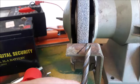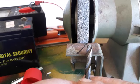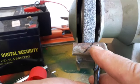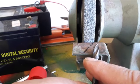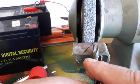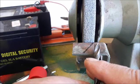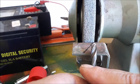Another very important factor: you see the cutting edge that I put last on there. If you look from the side, from the cutting edge to the back side, it must slope a little bit downwards. If I look at this one, it is rather straight or even runs up a little bit — and then it will never cut. That's exactly what this drill does, so I'm going to try and repair it.